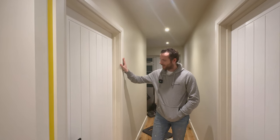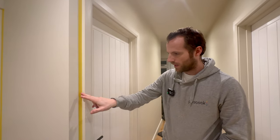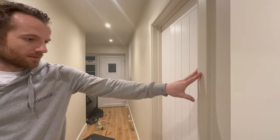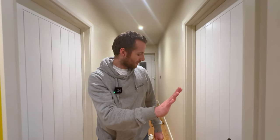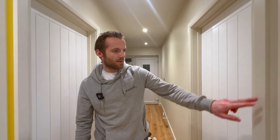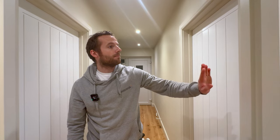The clamps are down, everything is glued and set, and it's looking pretty good. You can see I've already moved on to the next stage - frog tape is on, I've already caulked the joints ready to paint. On the other side it's had its final two coats of top coat paint and it's looking pretty tidy. If you zoom in you can see how tight I've been able to get that joint - clamped it, got a nice tight joint, used tape to caulk and paint it. I'd already pre-painted the wall so there are no ugly brush marks - it's a perfectly rolled wall all the way to the edge. That's how I get a perfect finish for architrave. Let me know what you think in the comments below and please subscribe.